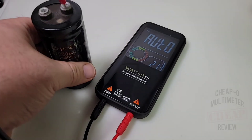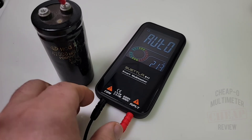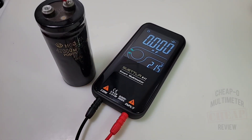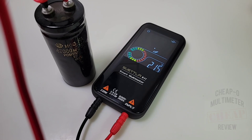Rolling into capacitance mode: I tried a 100,000 microfarad capacitor but it didn't work — it has a 99.99 millifarad rating, so it was likely just over the limit. Trying a 47,000 microfarad (47 millifarad) capacitor: hitting the capacitance button to get into the right mode, and the survey says — it's thinking. In millifarad mode, the bar graph slowly moves up and we get 44.5mF — that's a good cap.